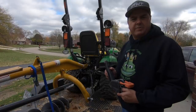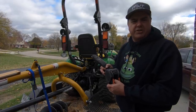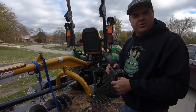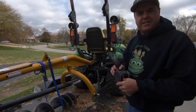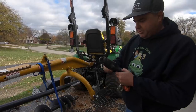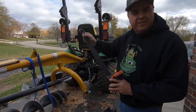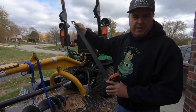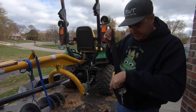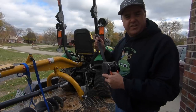We've got Johnny on the trailer now. We like to use these cargo buckles — they're much faster than the chain and boomers. That answers the obvious question of why we don't use chains: we load and unload the tractor frequently, so the easiest attachment approach is worth a lot to us. The advantage of these cargo buckles is when you open them up they auto-retract. You can pull them out and they auto-retract. If you want them to lock, fold that down and you can't pull them out. To ratchet them tight, you can ratchet them. Fast, easy, efficient — the best of all worlds.